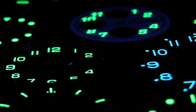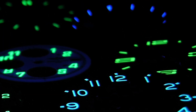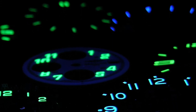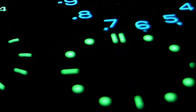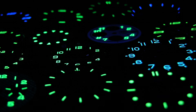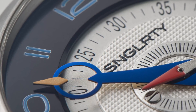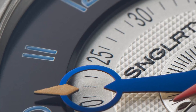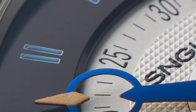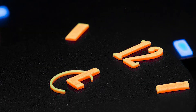Usually, if you've been doing printing until now, a printing will always look a little bit roundish from the side — a slightly elevated center — whereas at the border, the paint is not that high. Whereas if you do a molded piece, you can really create rectangular shapes, for example, or even give it a diamond shape. If I hold this into the camera, there's a certain layer thickness visible. That's the advantage — because of the volume on the side which is also created, you can also increase the luminous performance.